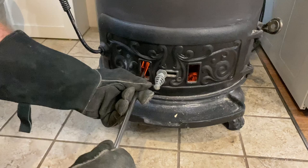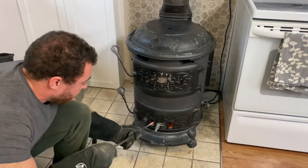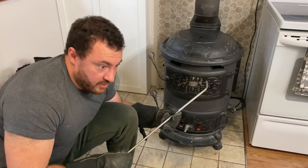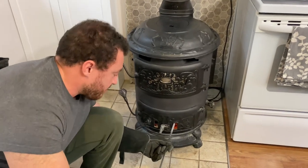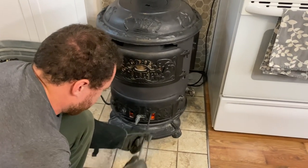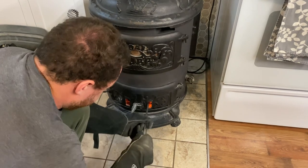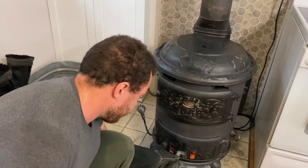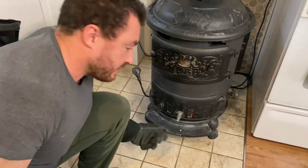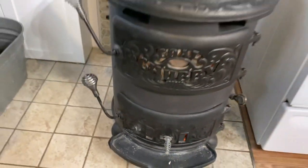It takes a little getting used to because obviously the disadvantage is that you can't see what you're doing, but this works pretty well and it is a lot more comfortable than lying down on the floor. When you're done on one side you can slide the fire poker into the other vent control and do the same thing. When you figure you're done with all the slots, close those vent doors back down to their normal burn setting — about an eighth of an inch open — and then you move on to the second step of servicing, which is shaking down the ash.